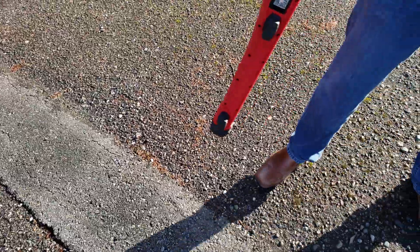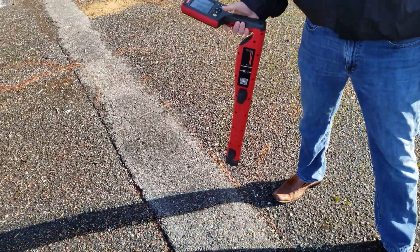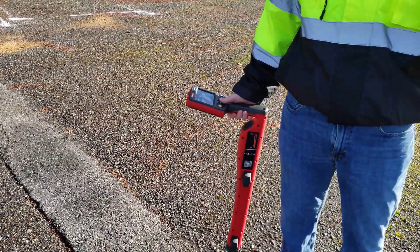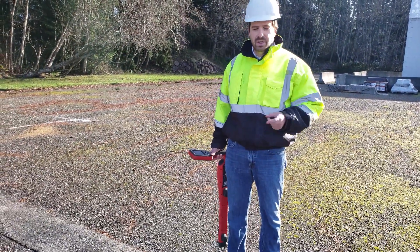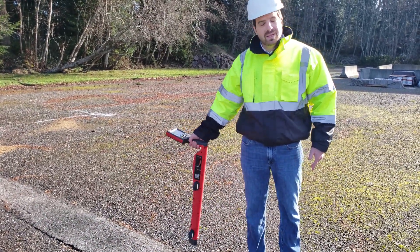The first thing is to know one point of the wire, and the second thing is to understand what is the direction of the wire. Know your environment, detect the clues, find one point after detecting the clues, and third, try to estimate the direction of the wire by playing with your wrist and adjusting the sensitivity of the signal.